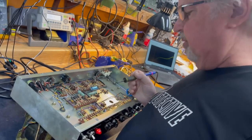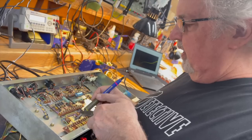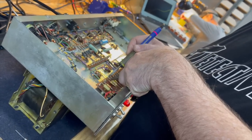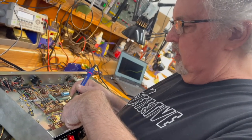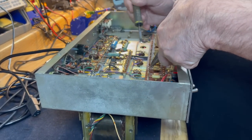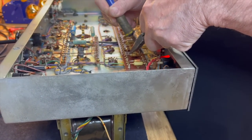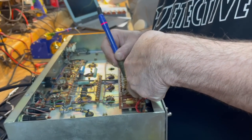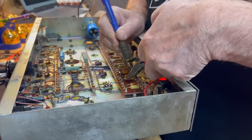This is going to be deceptively, stupidly simple. This frequency compensation network is comprised of two resistors and a capacitor. The resistor values are the critical component. The one I like, the resistor that's compensated with the capacitor, is 1 meg, and its voltage divider leg is 680K. On this one, the resistor that's bypassed is 1.8 meg, and the voltage divider leg is 1 meg. So we're taking the 1.8 meg out,